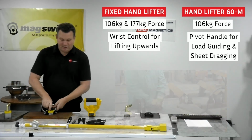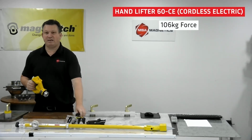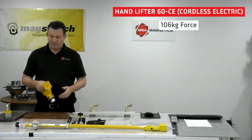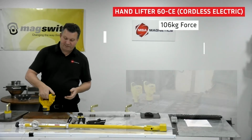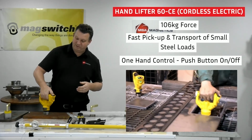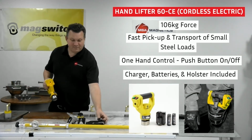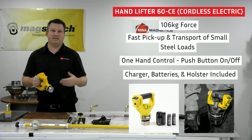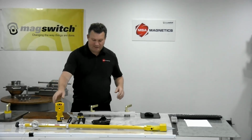In terms of the electric version, this one has 106 kilos of force. It's the same magnet that's in the 60M, so the manual version and the electric version. The electric version is taller, so it's not going to be very good at load guiding, but it is going to be very, very fast at picking a cutting table or moving sheet metal along, because the button to turn it on and the button to turn it off are very, very fast. You get 2 lithium batteries, a charger and a holster. Each battery is good for 2,000 actuations, which is 1,000 lifts, with 1 actuation on, 1 actuation off. Great tool.